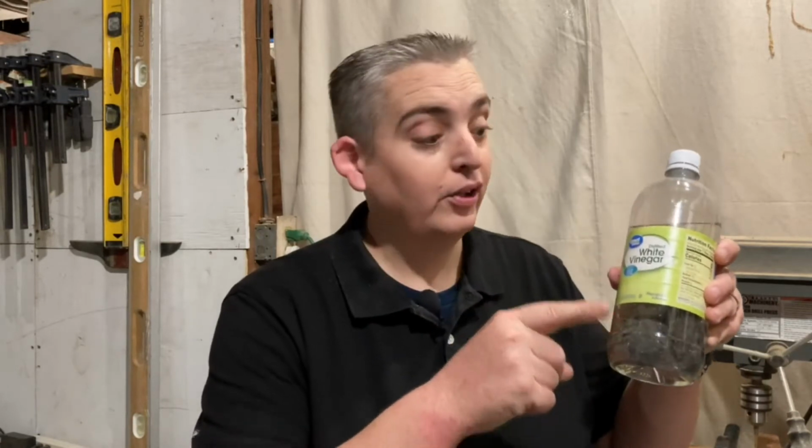Now one of these pots I'm just going to stain with regular stain, but the other one I wanted to try a technique I heard of called Ebonizing. Basically, you make your own formula, you put a couple pieces of steel wool into a bottle of white vinegar and leave it there for 5 to 6 hours. Then you take a sponge brush and brush the liquid onto your wood. And wait and see what the effect on the wood is. It's really cool. Assuming I did it right.